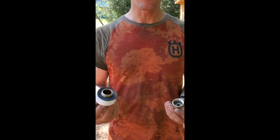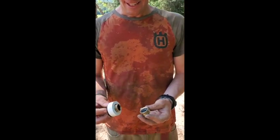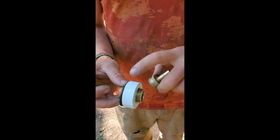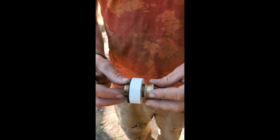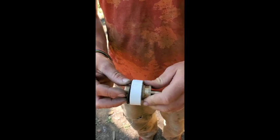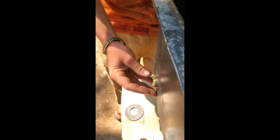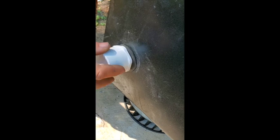I think we've finally figured out the nozzle assembly... we have not figured out the nozzle. Okay, I think now we might have figured out the nozzle assembly. We're going to put the spacer on, screw the nozzle on, and it's going to go on far enough to engage that gasket at the end of the nozzle. We have a homemade gasket on this side of the bushing for the inside, and on the outside with the threads that are left, we'll put another homemade gasket on the outside with the fitting that came with the microhydro.